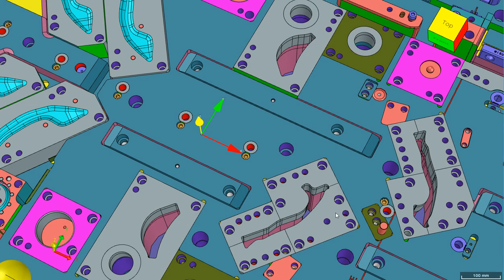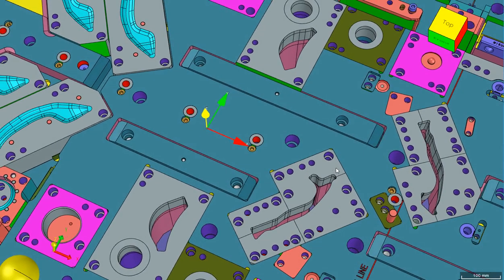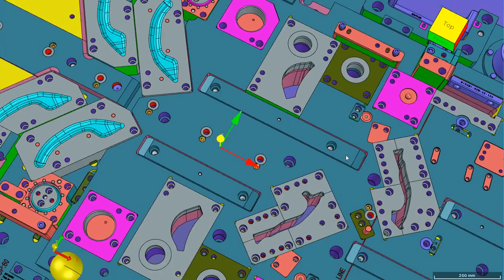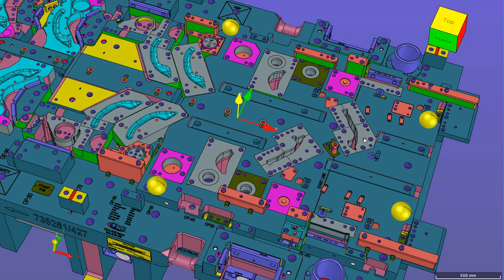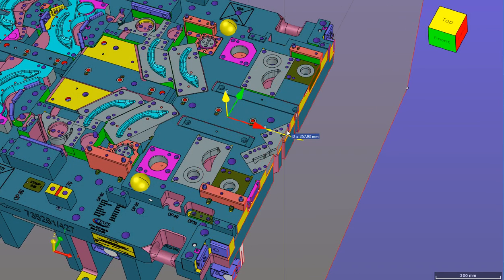We have provided four gas springs here. The gas springs are just to lift up the lifter plate — they do not withstand forming pressure or load; their only purpose is to lift the lifter plate or lifter bar. Since it is a big plate we give a minimum of three. We give one extra so that during operation, if any single gas spring leaks out, we still have one more to balance it. Even on the next narrow rectangular lifter bar we have given three gas springs.